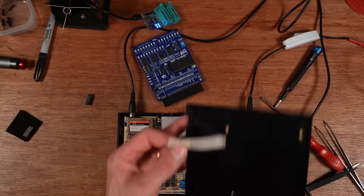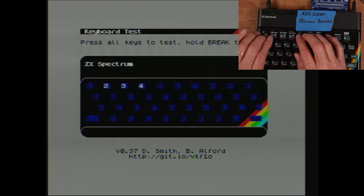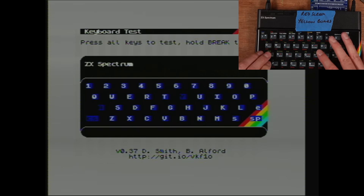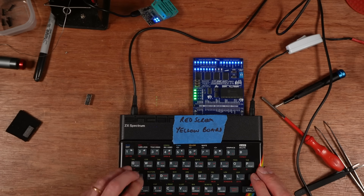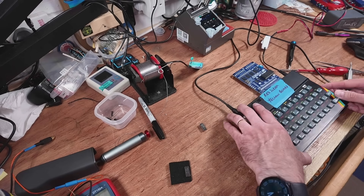The tails look good on this membrane, they actually look okay. Oh — I'm missing a column down here. Yeah. Okay, they've come back. I might check the soldering on the back of the socket — oh no, I've just noticed there is a crack in the membrane on this side. I'll take a picture so you can see it. So that's toast. Never mind — easily fixed. I'll button this one back up and send it back to Paul.